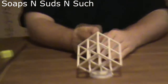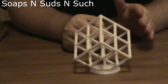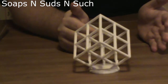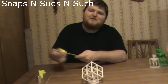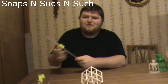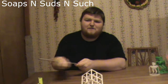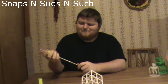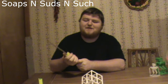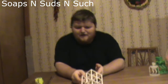This was an eight-hour print and it only layer shifted once and barely, which is a sign things are heading toward no shifting at all. If you want to get iGus bearings, you might want to do like my friend did and run them back and forth on the rod beforehand to wear them down so they move more easily together. I tried using PLA printed bearings and they would not move at all — they seize up when put together on the axis. I'll just stick with the iGus and let them wear themselves in all the way.